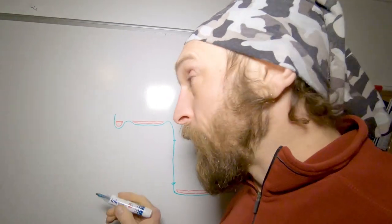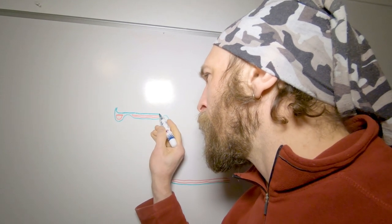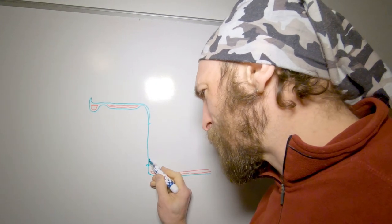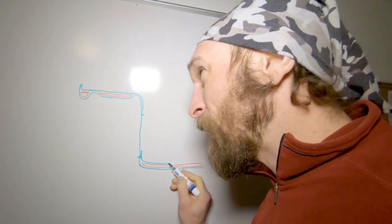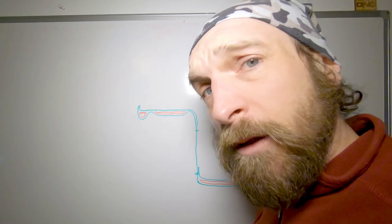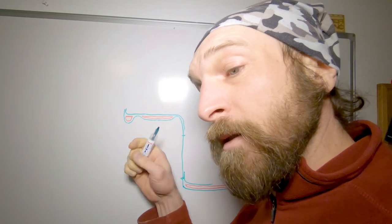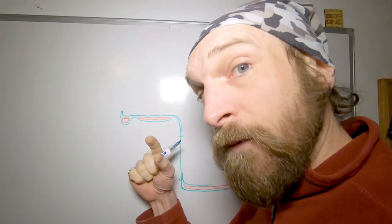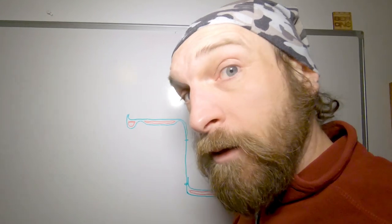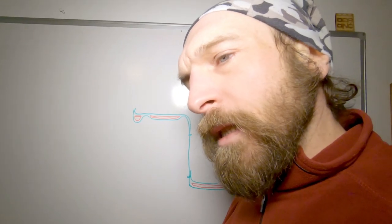And then covering over this, another layer of fiberglass, to form a coach roof. So these foam parts are encapsulated within the fiberglass, and this is how the deck is made. The decks are foam filled, and it is by them being thicker that they become stiffer without having to use a lot more fiberglass material, because it's the thickness which gives it the strength. So let's think about that the other way up and see what we're looking at.